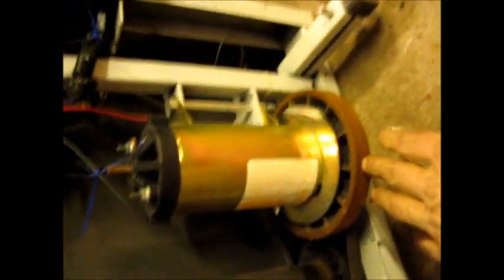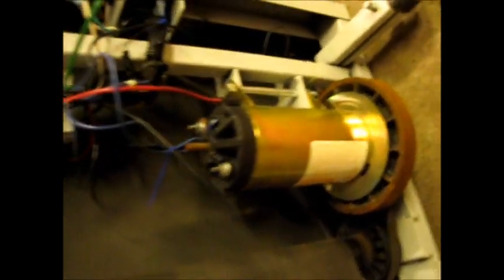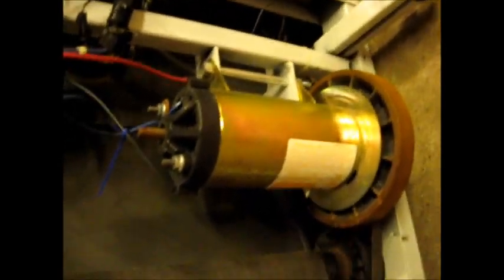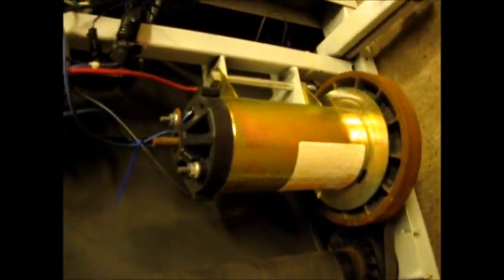That's what you want. Some treadmills have half-horsepower motors with a spring-loaded system — kind of like a snowmobile clutch — you don't want those. Those are just AC electric motors with a fancy mechanism to vary speed, and they're really inefficient and a big handful of trouble.